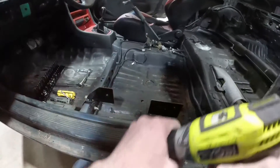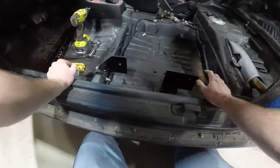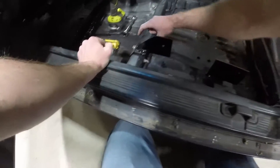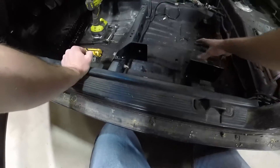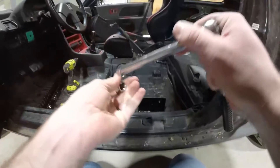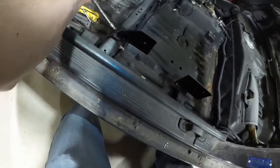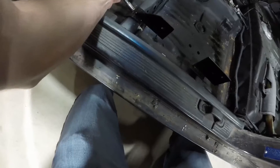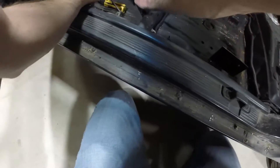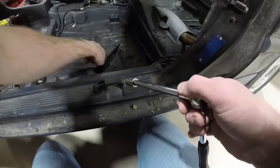The entire purpose of today's exercise is to get the geometry of these mounting holes, these cross rails, kind of the contour of the floor, the position of the steering wheel — so I'm getting all of that so that on my next version of these seat mounts, it's a cleaner all-around design. This one worked for what it needed to be, but it could be better.